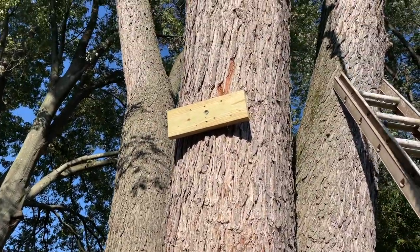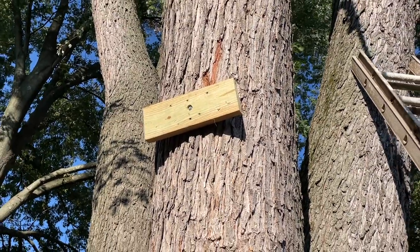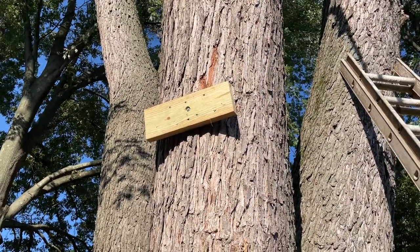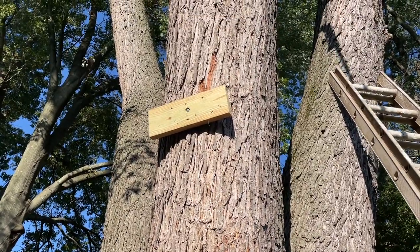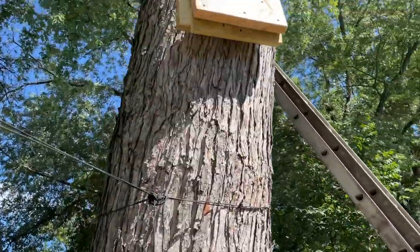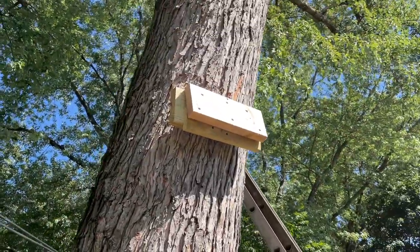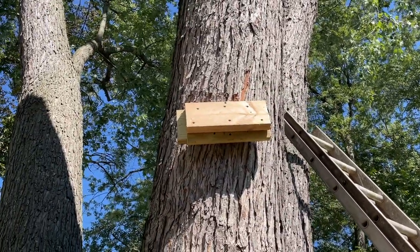Here is the mount base — a couple of screws and a bolt to secure it. It's a 15-degree slope, so we have to cut a beam with a 15-degree angle, and once we mount that, the backboard will connect to it. And here is our fancy leveled base — nothing special, just got to get it leveled so it's all even.